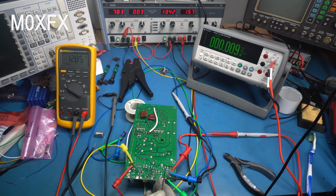I was obviously a little concerned because there's such a small gap in there, and it's essentially got 200 watts of RF on it. Again, I don't like the design. This could well have been a two-way switch, so when it switches over, they could have made it so that it takes the receive line down to ground, but they haven't done that. It's just a straight switch. As I say, they're normally open, because you can get them normally closed as well. But this is normally open, and we'll put that in and we'll see how it behaves.